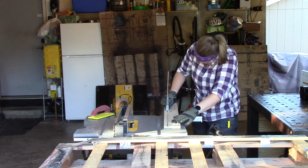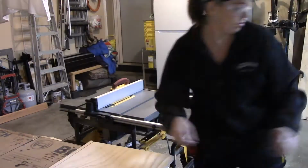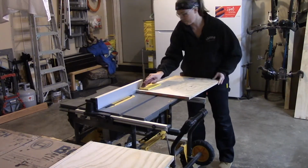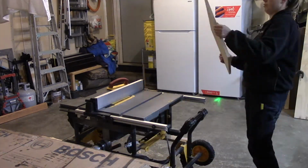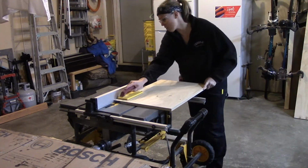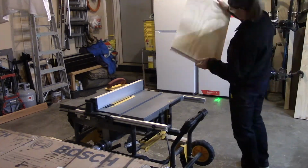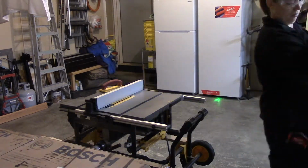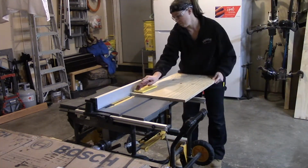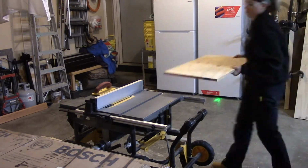Typically, I use a scrap wood to test my groove first before cutting my real materials. You want to make sure that the groove you're cutting is a 1/4 inch deep. You're going to run each side piece through this as well as your bottom, making sure that you're getting the sides lined up so that the groove is always in the back. You are also going to be cutting this groove into one of your 4-inch strips, and you'll see it at the end where that would go and how it all comes together.